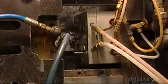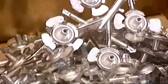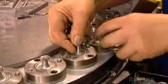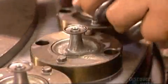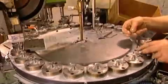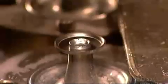A similar die casting system is used to make knobs. But the knobs come in two interlocking pieces. They place them on a turntable and fit them together. Then a 4-ton hydraulic press presses down on the knob, and that pressure seals them.